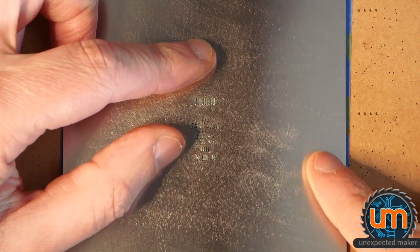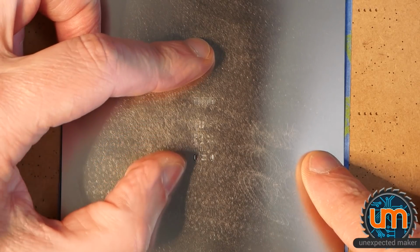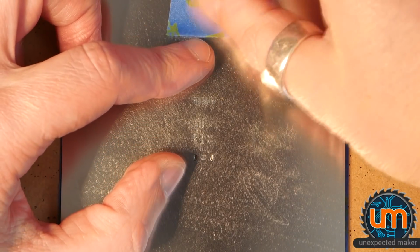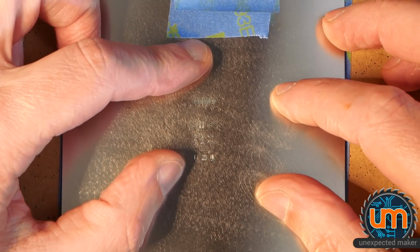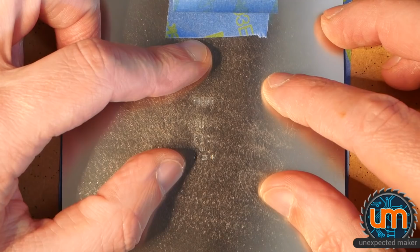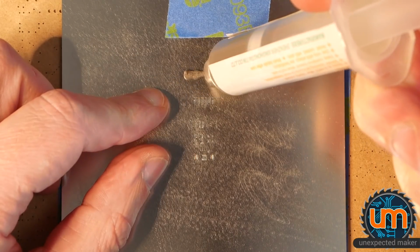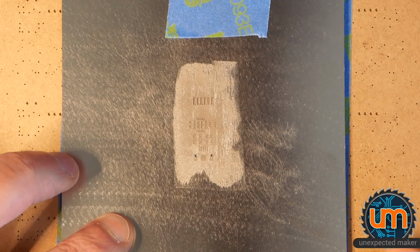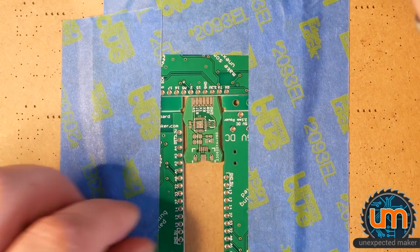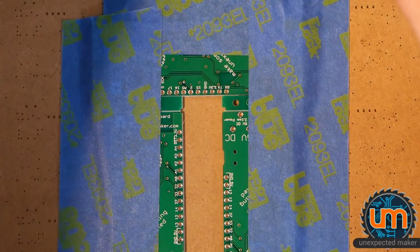It's all real. So just to refresh your memory, this is the USB side. So it's got a CP2104, it's got the USB connector, it's got the auto reset, it's got the 5 volts coming through, and the idea is to do this and then put the pogo pins on, and then assuming I can even get them on, and see if we can both power and program the Nano. Okay, I hope that's lined up. That looks awesome. I've not even got the parts out for this yet.